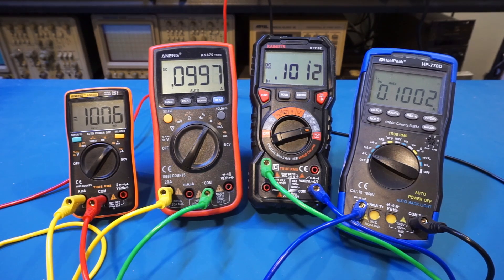With this resolution you can easily measure down to 10 milliamps with an acceptable error tolerance, which is more than adequate for most measurements you will be doing. Better yet, in the amp range the burden voltage is significantly lower than using a milliamp current range for the same measurement.